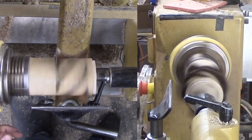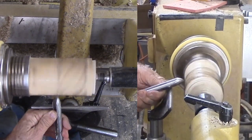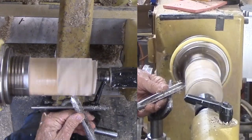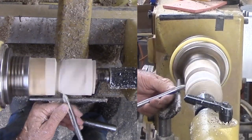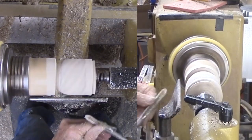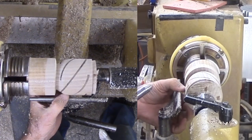With the wood again mounted to a chuck on the lathe, I can start by cutting back the excess wood from the slices. These like to splinter — remember that full face shield, by the way. Then I start to define the shape of the goblet's bowl. This is only to guide the hollowing and will be refined later if the goblet survives.